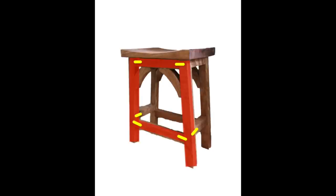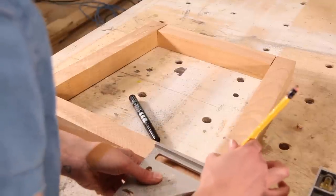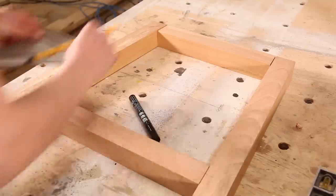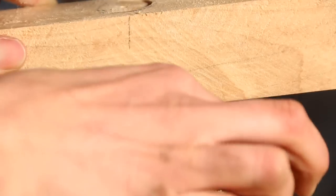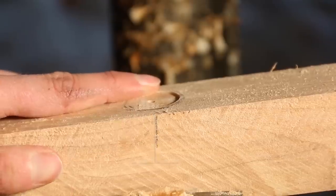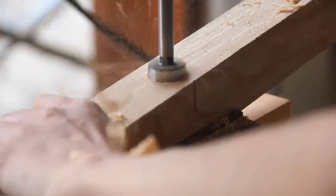Then I started working on my legs. I started by making the front pieces and a matching back piece. I arranged the pieces where I wanted them, measuring 4 inches from the bottom and keeping the top pieces flush with the top of the legs. Then I marked a straight line at each intersection so I knew which angle my dowels needed to go in at, since some of them will have to be on 5 degree angles. For the long legs, I cut a small piece of wood to angle the wood 5 degrees horizontally so that my dowel hole would go in at the proper angle.